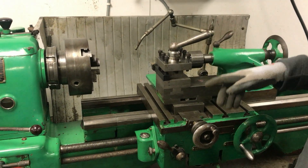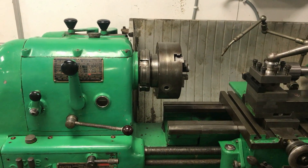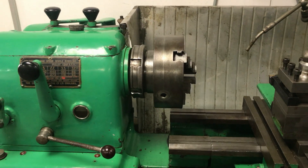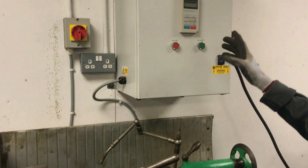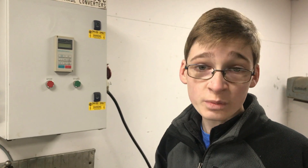While we were doing some metalworking, we noticed firstly a screeching noise coming from the motor or something down that end. But worse, the motor seemed to be stop-starting a lot, which was then putting the digital phase converter voltage all over the place. And we got a 3-second bit of video of it doing that — it's not the best, but we'll play that now.